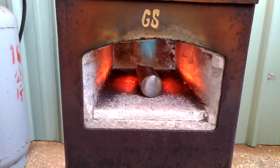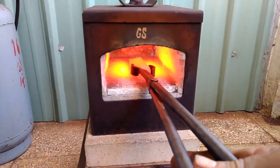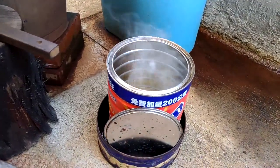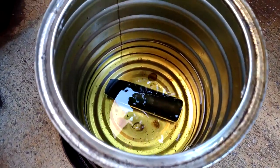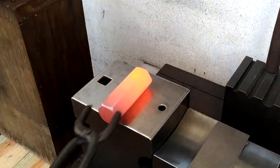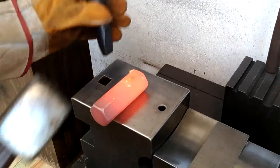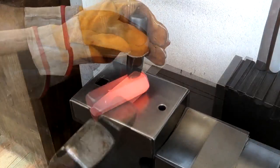I'm holding off on relining my forge with the new material I recently purchased. I've gotten back to oil quenching after discovering soybean oil and how it doesn't flare up, at least for me. I'm a little low on oil here but it'll work — I've found this very effective for medium carbon steel. Just that quench is enough, no need to anneal. I just want to take a few taps before using the alignment tool to get my marks right where I want them.